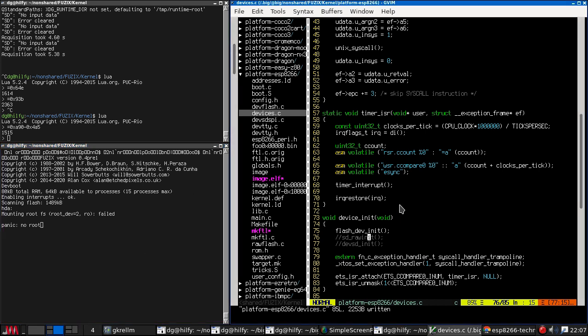That'll involve reflashing. It's not a big deal. It just takes a while. But once that's done, I should be able to do some work on the TTY. And that means once the TTY works, you can actually interact with the system. It should be, finger quotes, done. There's some tidying that needs doing because there's a fair bit of hackery in here. And clean up. The biggest missing thing is the SD card. The system running out of flash is just not usable.